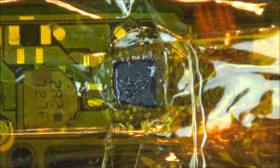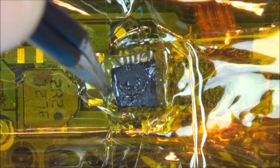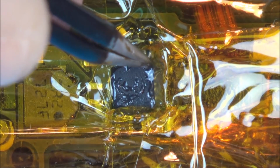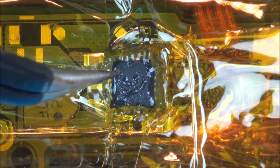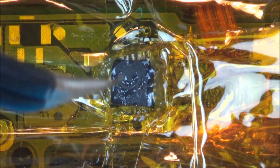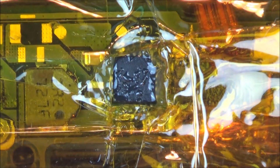Okay, I find it very hard, if I'm honest with you, because I put so much tape on it, I can't actually really see the edges of where it should be going. But if I take the tape off it, then I'm just going to melt everything around it. I think I'm just going to go with that and see if surface tension will bring it in, because when it's close, the solder should want to stick to each other, and it should kind of suck it into place. Let's give it a go and see what happens. So I'm doing the same again, 480 with the same airflow.